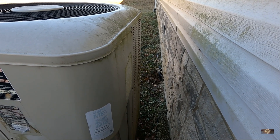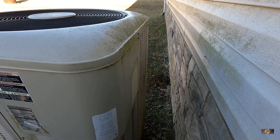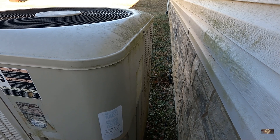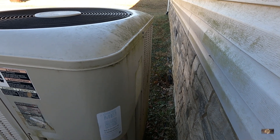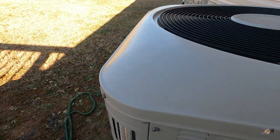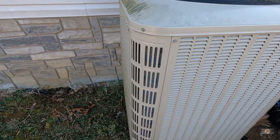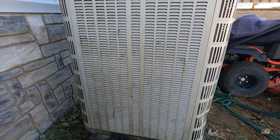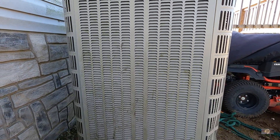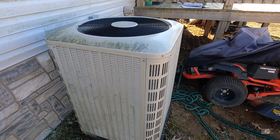I'm going to go ahead and write them a bill and make sure I've got a good temp split inside before I go. I made some recommendations for float switches on this unit — it does not have any water protection at all. A maintenance probably wouldn't hurt either, since this is a micro-channel coil inside and outside. They're only going to do what they can do — I figure I've got to give them the facts and they can decide what they want to do. Thanks for watching, I appreciate it. If you haven't already, hit the like button, subscribe to the channel, and leave a comment. You guys stay safe out there.